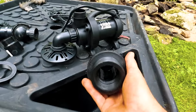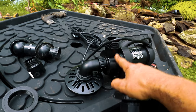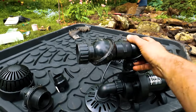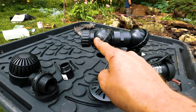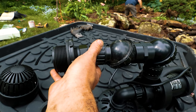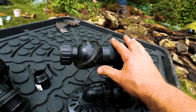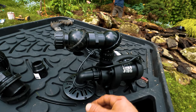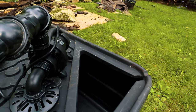To connect the plumbing, I'm using an inch-and-a-half bulkhead. I've lined everything up using the fittings that come in the box with the new AquaSurge pump. This contraption will ultimately connect to our bulkhead. One of these connectors has a spinning collar on the fitting, which lets us remove the pump for servicing or for winterizing. I lined everything up and made marks on the side where I need to drill the bulkhead fitting through the wall.